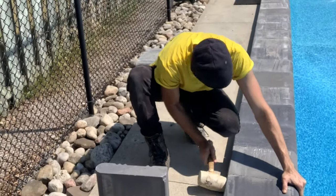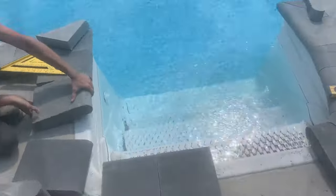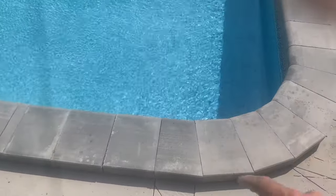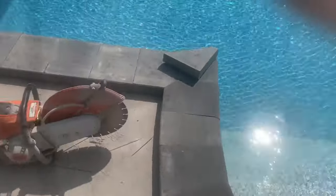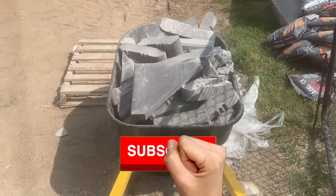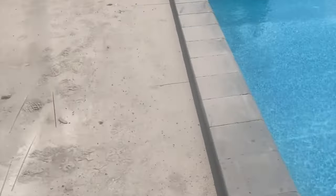Making sure everything is straight once we get all these copings in and we start leveling the ground and installing some pavers. Every time you cut, you cut off a little bit on each block to do the curves, and you end up throwing pieces in the garbage. Always get a few extra blocks — like that you're not missing any. You got a full wheelbarrow right here, this is all waste.